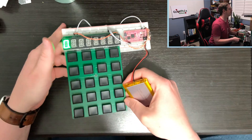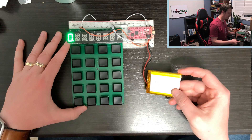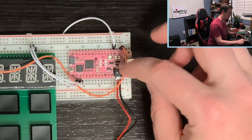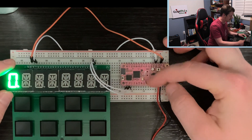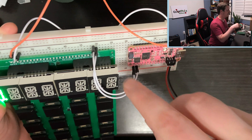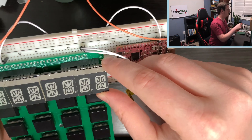This is the prototype. There are a couple things wrong with it, but it is a great start. Let's go to the overhead. This is a 3.7 volt, 2500 milliamp hour battery plugged into the RP2040 microcontroller. I have loaded Python code onto this microcontroller that speaks over the I2C lines. These two short white wires here are the I2C lines — you can see SCL and SDA are the two pins coming off of it, going into the SCL and SDA lines on my board that I've designed.